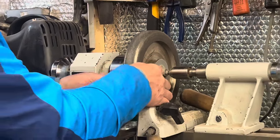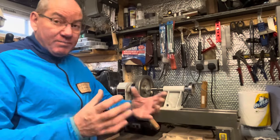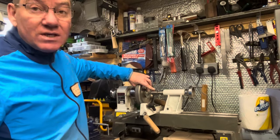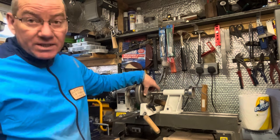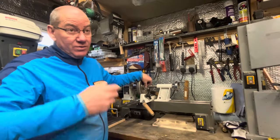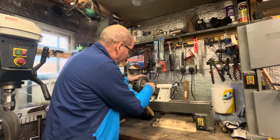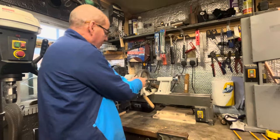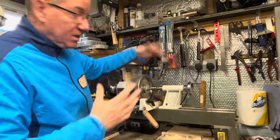And as long as it's bolted up, now you could use, if you ain't got a grinder to take apart, you ain't got a spindle, get a nut and bolt, big nut and bolt that fits your thread. If not, you can get bushings for it. If you ain't got bushings, make one, get one made, whatever. You're a wood turner. You can turn things, make a bushing up for it. But if you get a nut and bolt the right size, put a washer either side, bolt it right up, and then chuck it in with the washer, and it's fine.